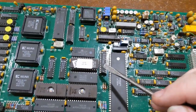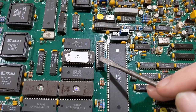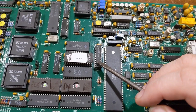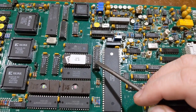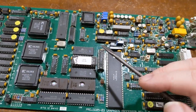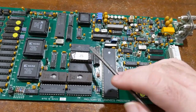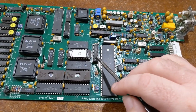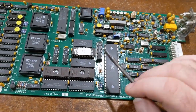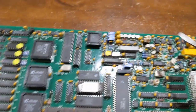This is another programmable logic. This is registered logic, so I don't have the logic inside this chip because these are not easy to do. This is basically a pixel clock gate. So the pixel clock runs at 14.318 megahertz through this board because it's NTSC. And that is the master clock for this chip. And there's some signals that go between the FPGAs and other things that are required for video timing. This chip handles that.